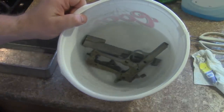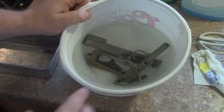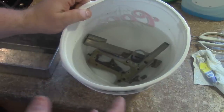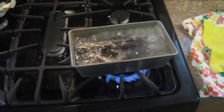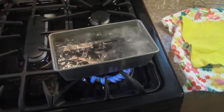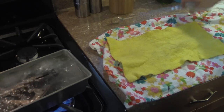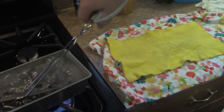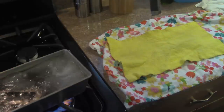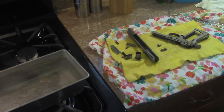My parts have now been pretty much stripped of all their bluing, though they've got some funk on them still. I'm going to take them out of the vinegar solution and boil them in plain tap water for about 20 minutes. The parts have been boiling for about 20 minutes, so any red rust has been converted to black rust, which should pretty much finish stabilizing the metal. I'll pull them out and get the water off — at boiling temperature, they pretty much dry off on themselves.